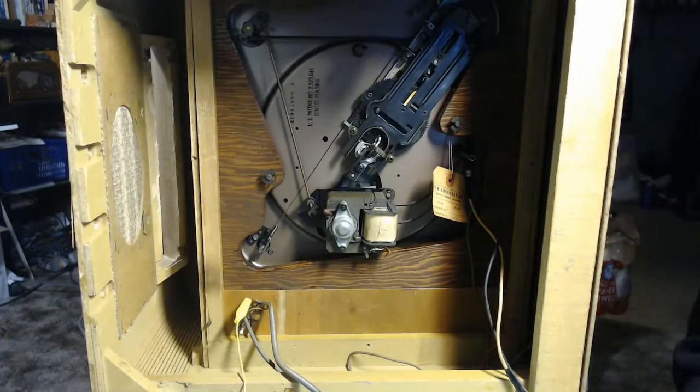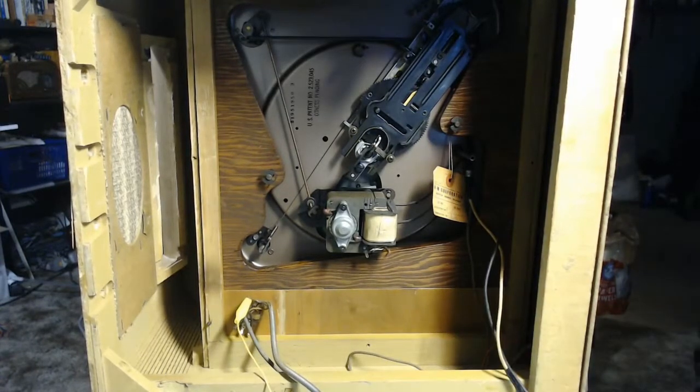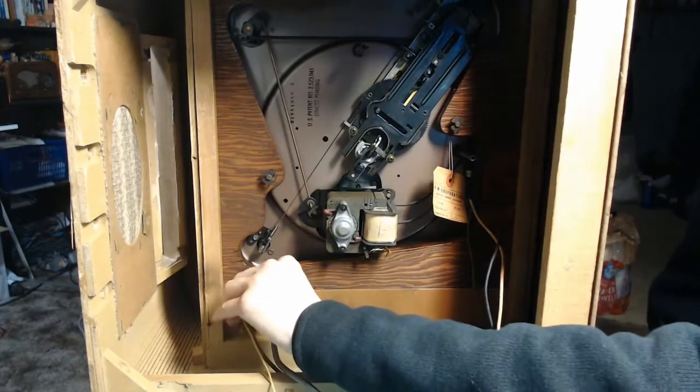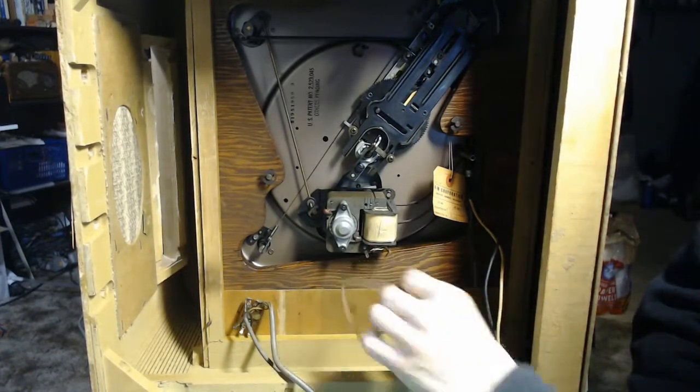Oh, and for reference, the cartridge that I installed, the one that comes with the KCCA kit from Voice of Music, is a Phono P228 cartridge, ceramic type. And yeah, fantastic little kit for doing conversions on anything that has a half-inch base. I think they even offer another kit, the KCCB, that's designed to be glued into the head shell of the tone arm in the event that it doesn't have a standard mounting size. But that's all of that for now.